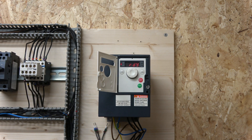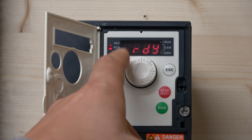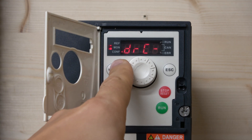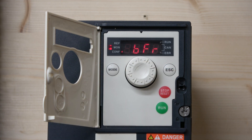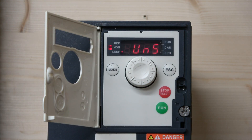To get going, the first thing we need to do is enter the motor parameters so the drive knows what motor we are using. All that data is on your motor nameplate — that is the key to understanding which parameters to enter into the drive. We need to go to the DRC parameter group. Note that when you are in remote mode you don't need to press Escape to access parameters — but the drive must be in a stopped state. Go to DRC and the first parameter is BFR.